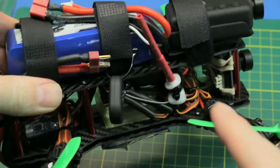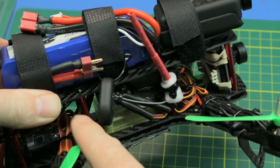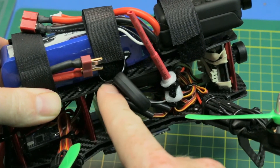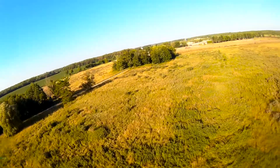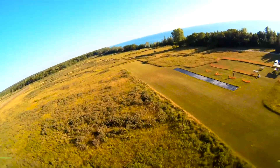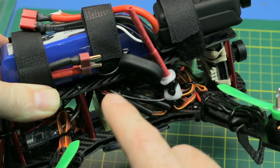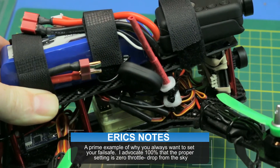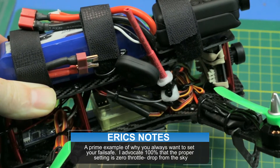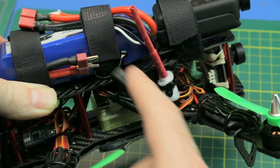Overall I'm pretty happy with it. One mistake I made early on was having the antenna for the radio a bit obscured in the carbon fiber — huge rookie mistake. Long story short, carbon fiber does not allow RF energy to pass through and you end up crashing. Easy fix — got that outside the frame, and I'm going to get it up higher in the future.